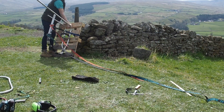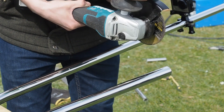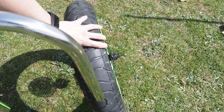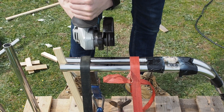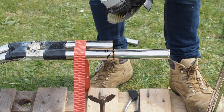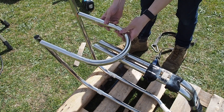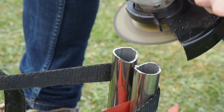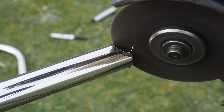I've measured the length of tube needed and marked up where I'm going to cut it. To hold the rear wheel in place I'll be using the U-bend from the first video, and now I'm cutting out a space for it. Because the tube is round I'm going to grind out a little bit of these two tubes so it'll fit better and create a nicer weld. I'm doing the same on the down tubes — cutting a little slot so it'll fit around the U-tube more cleanly.